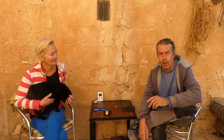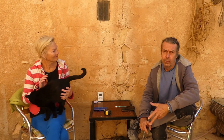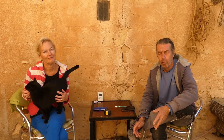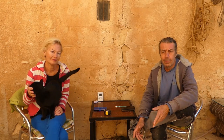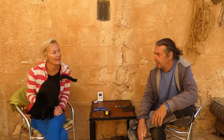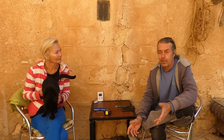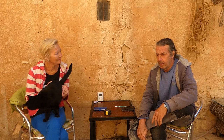No harm done apart from a lot of expense. We're currently only on four panels while we're waiting for parts. I spent the bulk of yesterday figuring it all out and sourcing the stuff — most of it should be here today and the cables are scheduled for tomorrow. Going forward, there are going to be three arrays — two of four panels and one of five — each with their own independent charge controller, so the load on each set of cables is way below what they're designed to take. The lesson is: if you're upgrading your solar system, make sure your cables are up to the job.